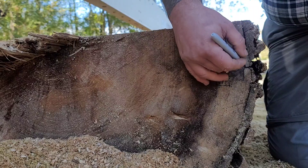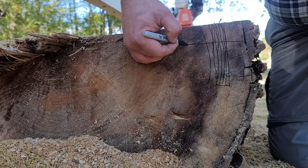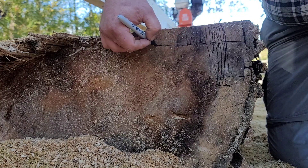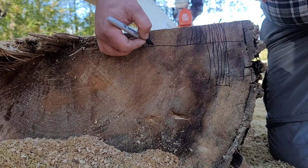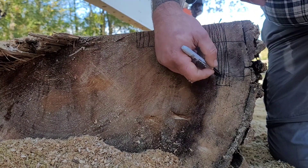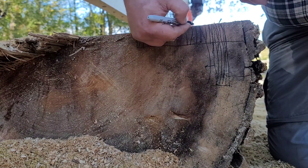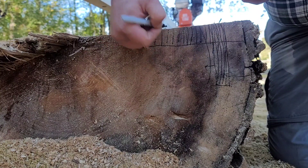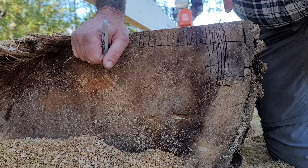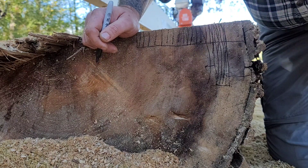So instead, starting on this piece, what I'm going to do is cut two-by-fours — that's about where we're set up. I'm going to go over four inches and up two. Now what's going to happen is these growth rings are oriented this way. So if the next board gets cut here, my growth rings are like this, now oriented in that direction. It's not got all the pressure going in one direction. By quarter sawing it and having the growth rings going up and down instead of side to side, this wood is going to dry and hold its shape — it'll be real hard to get this piece of wood to bend.